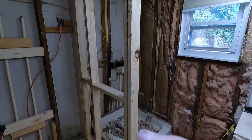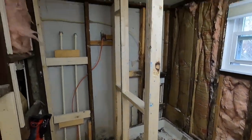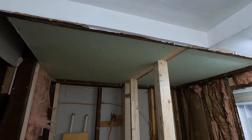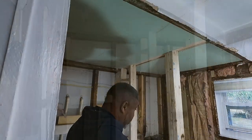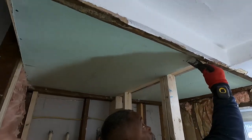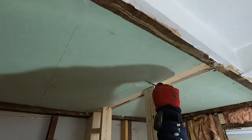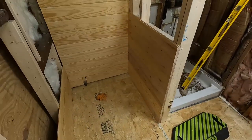It's starting to look like something. You can see we framed a wall up right there - that's boxing in the shower. We've put up the mold-resistant sheetrock for the ceiling. Slowly but surely, Jeff's putting a little bit of sheetrock mud over all the screws, starting to cover them up, sanding it, getting it ready. This is the next day and we're shiplapping.